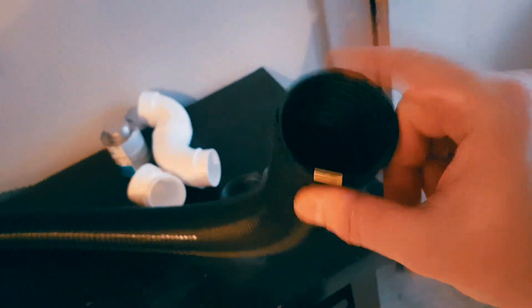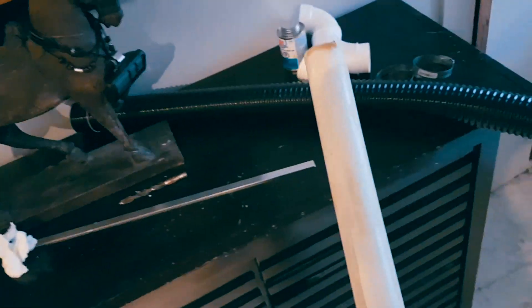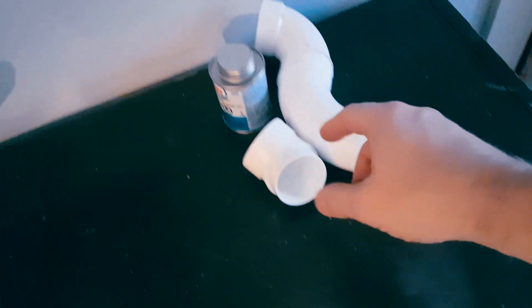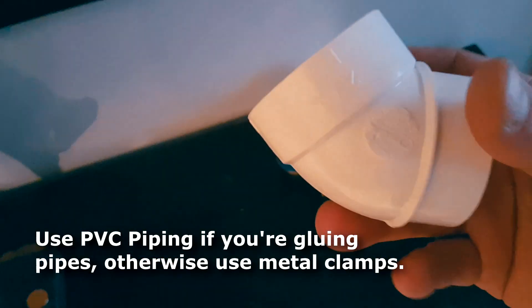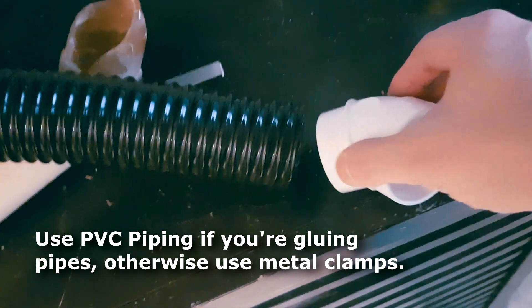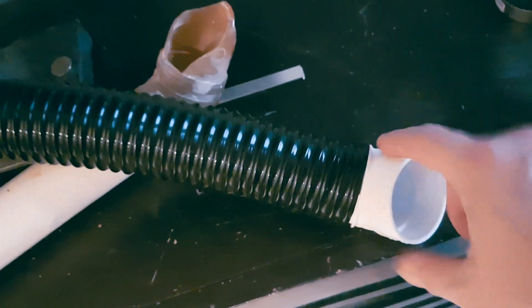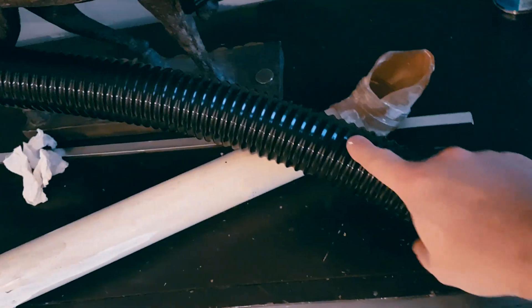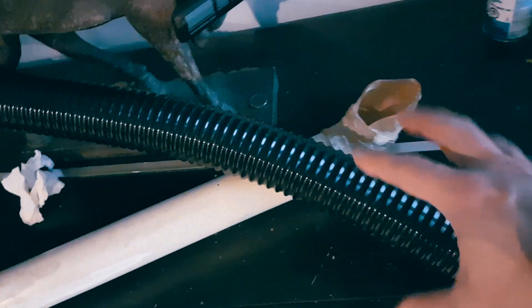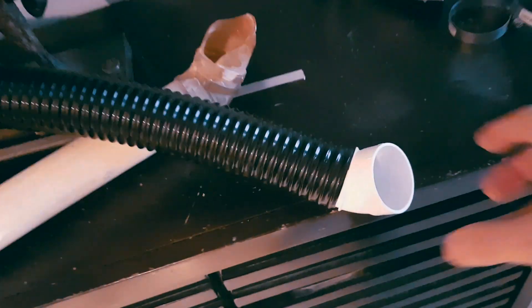To fix our problem, we found a flexible central vacuum hose. This is really nice because it bends and you don't have to fuse different elbows. This is obviously the one that cracked. We will need some couplers — here is one. This is a two-inch pipe, so we need a coupler to go in here like so — this is a perfect fit. You can find this at Home Depot; I grabbed this one at Lowe's but Home Depot sells them as well, and perhaps on Amazon too. I'll find the links and leave them below.